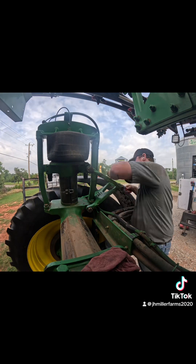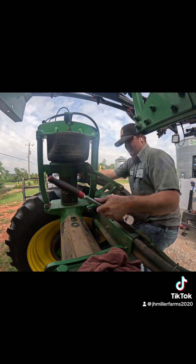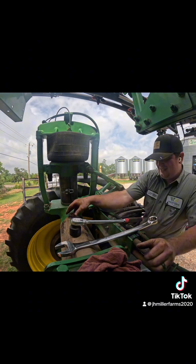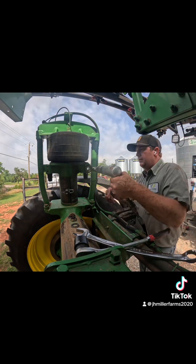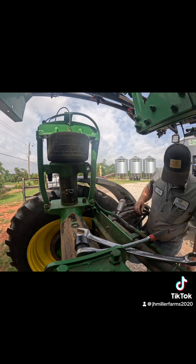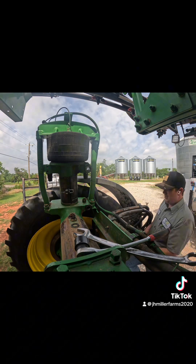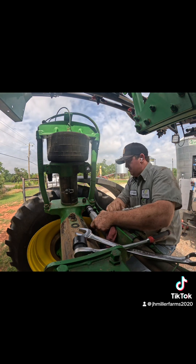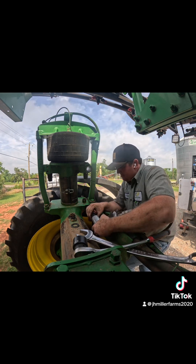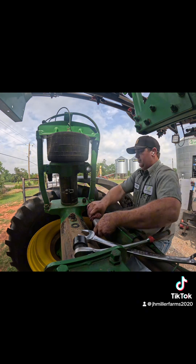The cause of it is the scissor suspension that these sprayers have on them. There's three pins and a set of bushings there, and they'll get some play in the bushings and pins. It doesn't take a whole lot — in each little bushing and pin, there's three pins, so it all adds up. It makes it so that tire can move quite a bit and cause it to road walk.